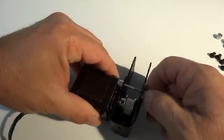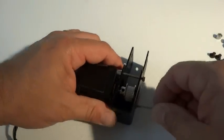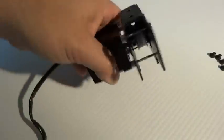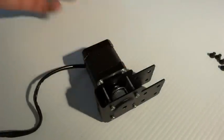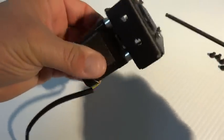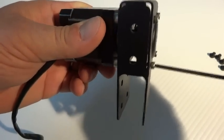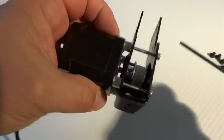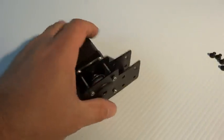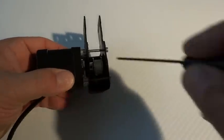Take your aluminum spacer, put it on there. I'm not going to tighten that all the way down because I need to have room to get the other ones in as well, so go ahead and work all four of these in. Tighten these down but don't over-tighten them. The ones with the solid backing and solid bent area you can tighten a little more, but you may still need to loosen them. Leave this one a little loose because when you go to put the V-slot extrusion in here you'll have to separate them.